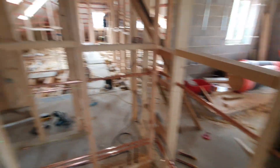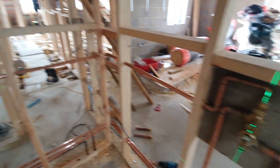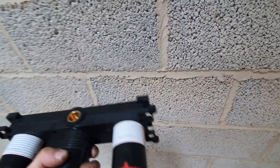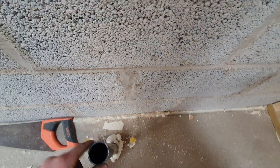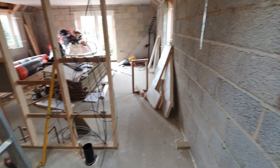That bath tap is all set up now. Taking it around in 22mm because I've got a waterfall thing going over here - I haven't actually got that on site yet. It's only 15mm working left to the shower, but I decided to do it in 22mm just to give it a bit more flow. That one's all piped up ready to go. Just got to do a bit of chasing now. This is the basin tap - obviously hot and cold - it just goes that way. It needs to be sunk into the wall and there's a wall hung unit going on here as well.